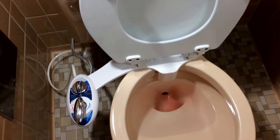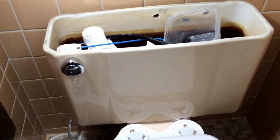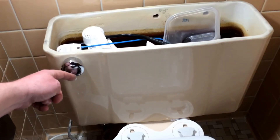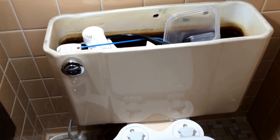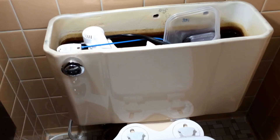So I'll have to take a look at that. Hopefully it's something I can just clean the seal or maybe replace the bottom valve itself, because it's a fancy-pants flapper valve — somewhat European or Japanese style, with a number one and number two button. Number one gives a small flush, number two gives the full flush. I also discovered from Corky, who makes this anti-siphon fill valve, that it has user-serviceable parts, which I didn't know existed. I'll put a link in the description to their three-minute video, and I'll probably clean those parts while I'm at it too.